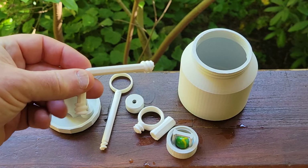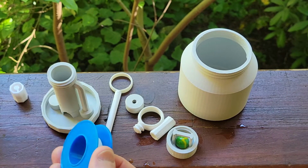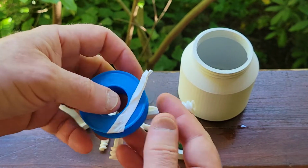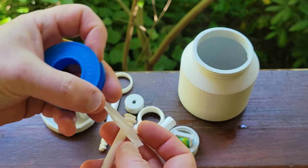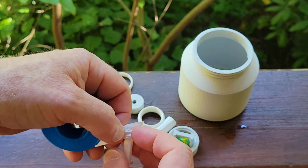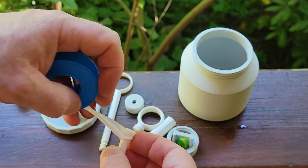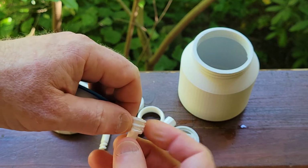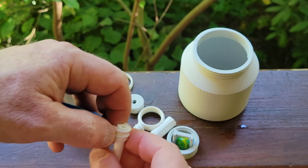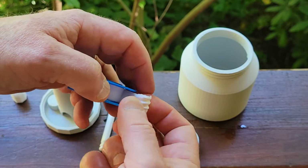So we'll start with the outer pipe. Take a little bit of plumber's tape here, and we're going to wrap it in the same direction that the threads go. And there's no exact number of times to do it. I find going around 2 or 3 times, that's 1, that's 2, and that's 3, will get me a pretty good seal.